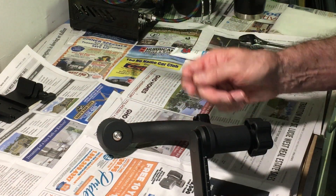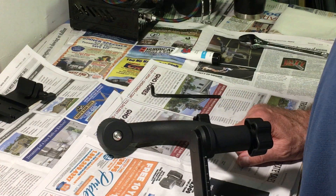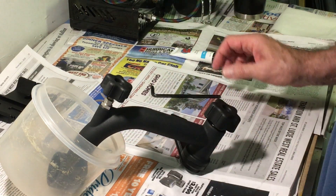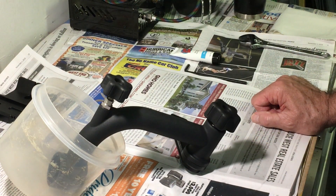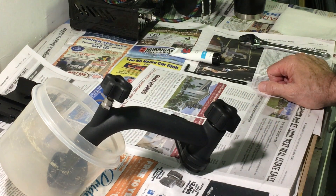Here's what you have to do: boil some water on the stove — three or four cups — get yourself a little bowl like this, set the tripod head in there, pour your boiling water in, and that boiling water is going to heat up the part. It's going to break down some of that viscosity of the lubricant and hopefully break free whatever is holding that bolt so tightly in place. I left mine in there for about 20 to 25 minutes. There was a guy on YouTube who held his in a boiling pot of water for 45 seconds and had success that way. I just didn't want to hold it over a boiling pot, so I soaked it longer.